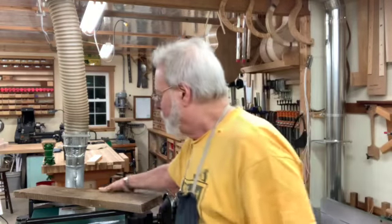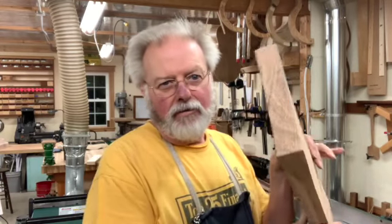And remember, you cannot, with only a jointer, unless you want to do a lot of hand planing or some other slick tricks, without a jointer and a planer, you can't go from this to this. And for me, that's imperative, because I go literally from billets and planks of rough material all the way down to whatever parts I need, whether it be for guitars or utility stuff or for furniture or, you know, even some architectural millwork. So to me, these tools are very important.